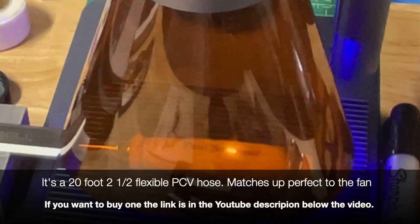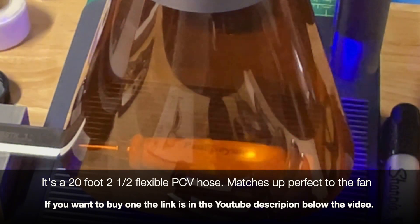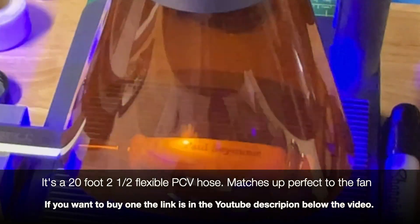I'm not really smelling much — just a teeny tiny bit of smoke, but not bad. Yesterday I smoked up my old shop, so you definitely need some sort of ventilation with these. I did order the fume extractor but it's not in yet, so I'm just using this hood and it's working good. If you do like I did — about 30 feet of PVC, I believe two and a half inch — some vinyl tape worked perfectly to mesh those two together, then I just ran it right out the door. You can run it out a window too.